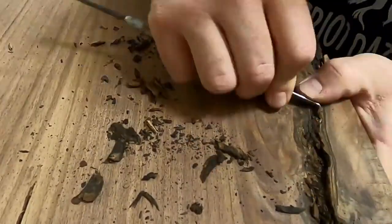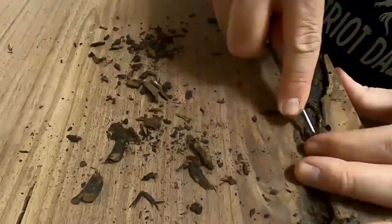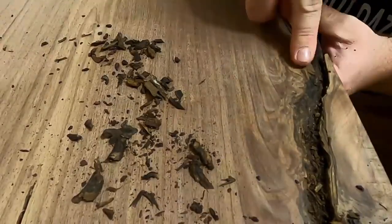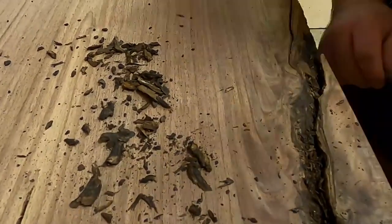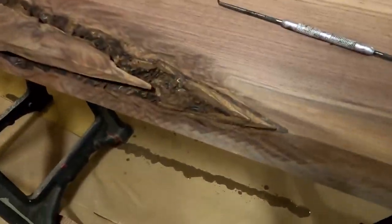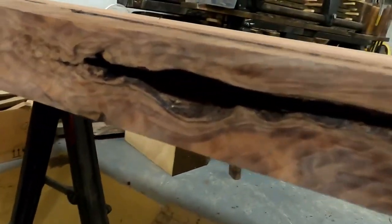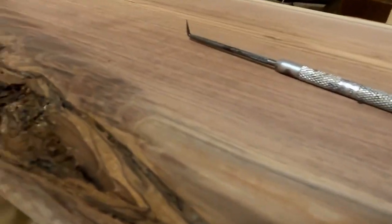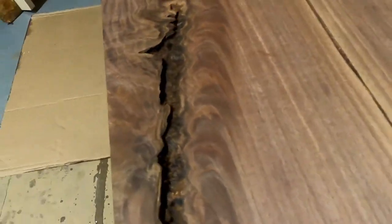Because we are going to fill this with ocean blue metallic, I just don't want to have anything that's going to move over time. Although the video speed is sped up here, I'm going pretty slow and just kind of poking and checking with my little pick. It's kind of a long process — it takes a little time, but in the end it's just going to pay off. Here we have kind of the final product: it's cleaned out. You're seeing a lot of little rough edges, but that's fine. The epoxy is going to fill in this void and it's just going to pop along with that awesome grain from the bark inclusion.